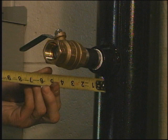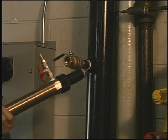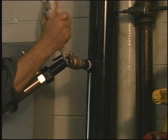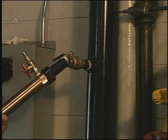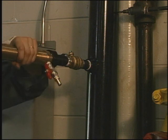This measurement is the minimum amount of stroke required before the cutter makes contact with the pipe to be drilled. If the distance is greater than 11 inches, the machine may not have enough travel to safely complete the tap and this operation must be aborted and reconfigured. Attach the fully assembled and fully extended tapping tool to the outlet thread of the valve by screwing on the valve adapter. Pipe sealant is recommended for NPT valve adapters. The valve adapter should be firmly tightened so as not to leak.